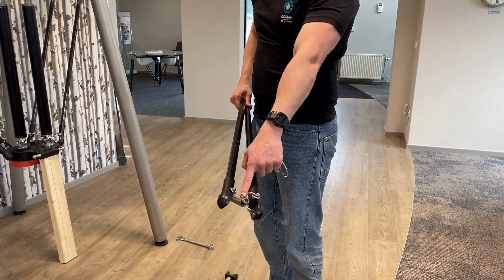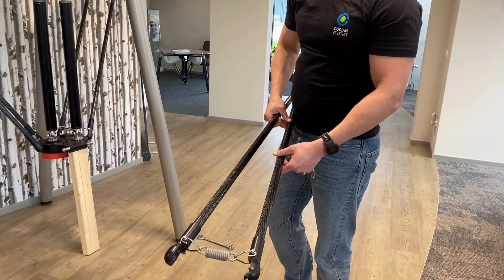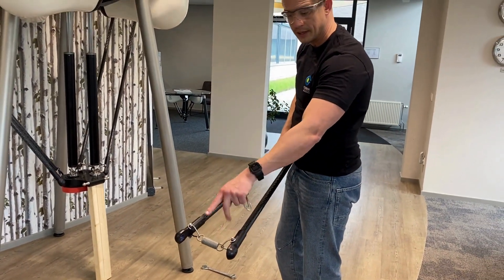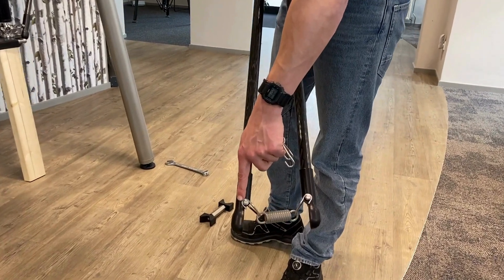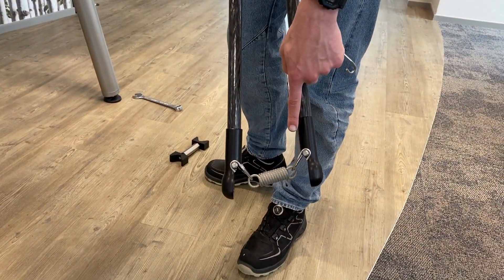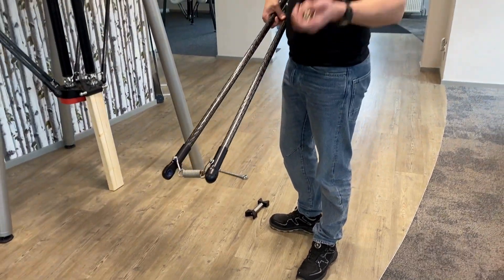In this case I will leave the bottom side on because it is more or less really easy to change. What is important is that you take a look at the spring position. In this case the way they are mounted now, with the hooks down — this is the way the bottom springs need to be. This is important. The top spring I will show you in a little bit.